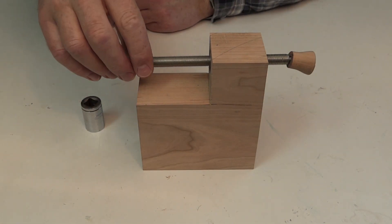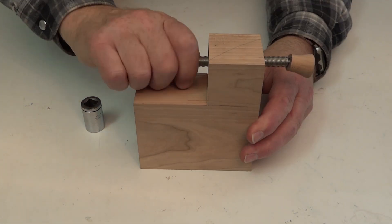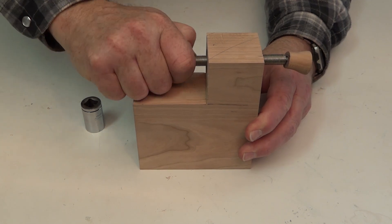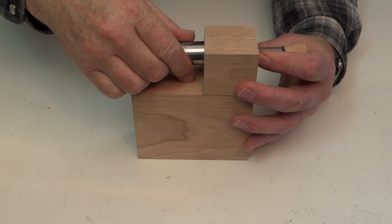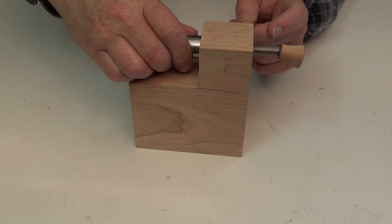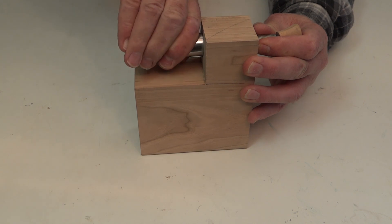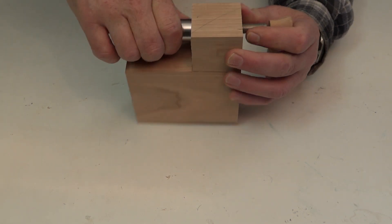That's going to work just fine. I don't actually want that nut to be in there that tight — it's just like double-nutting something and of course it won't turn — but I will put it in that tight while I put epoxy on the first side, and after the epoxy sets I'll do the second side a little more loosely.